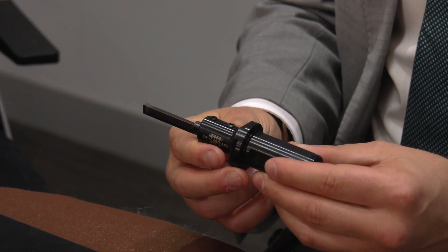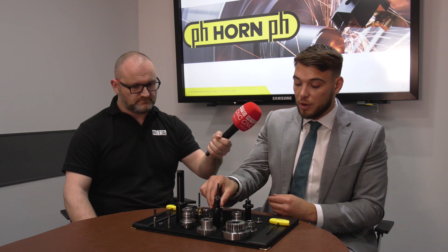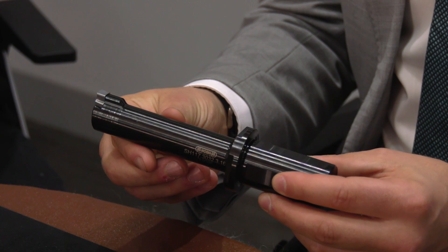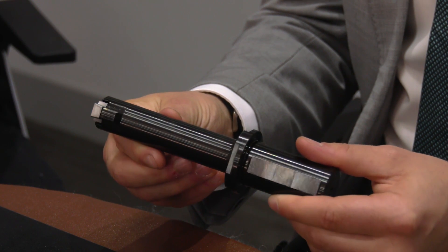Moving on to the N110 system, which is essentially a bigger adaptation of the N105, designed for longer reaches. Again, we offer a number of keyway sizes, hex broaching, and Torx and Torx Plus. Moving on again to the larger system, the S117 broaching system — here we're getting into deeper bores, longer forms, and we offer similar styles for a number of different tolerance class keyways as well as hexagon broaching systems.